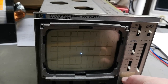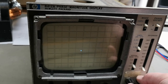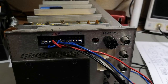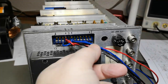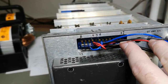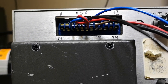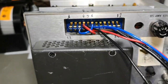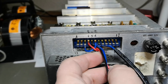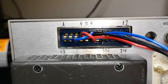We got a little dot on screen — I call this a winner! Focus seems to be working as well. I traced the missing plus and minus 20 volts back to the blue connector exactly as I suspected, and connecting those missing signals restored all the missing voltages on the power supply. I cannot find this anywhere in the documentation I have, so here it is for your free use.